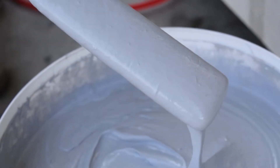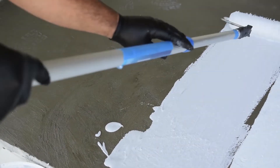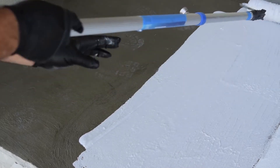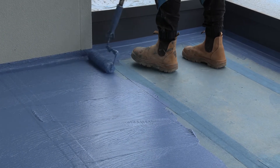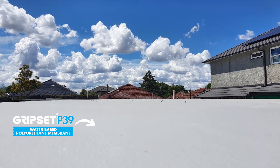Sometimes they are the products that give you a far greater benefit over a sheet system when you may have a substrate that could be slightly undulating. It could be a mineral surface like a concrete or a screed surface where it needs a liquid membrane. It might need to have a system that's breathable, and that's where a liquid membrane can offer you the differences between a sheet, which normally has higher vapour barrier properties. Understand that things like surface preparation and detailing stand for both systems, but the liquid membranes you can use successfully as long as you understand the limitation of that product and what it's designed for.